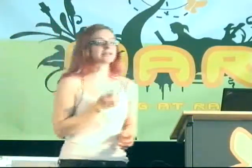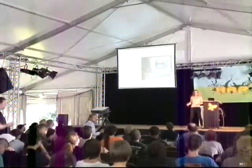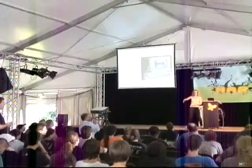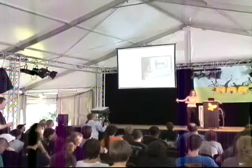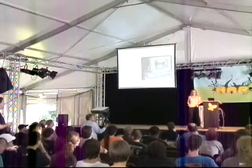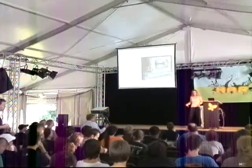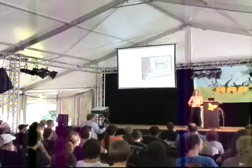The cyclotron chamber itself is about 20 centimeters across and about 4 centimeters high, but it's the magnet and the magnet power supply that are very large. The magnet itself — at least the one I was using — was about a meter cubed, the power supply was about half that size, and the magnet itself weighed about 300 pounds. The whole system could comfortably fit in a footprint of about one meter by two meters.